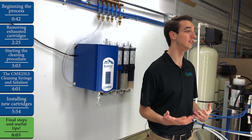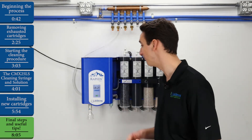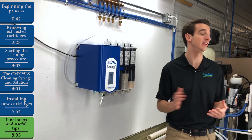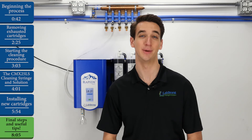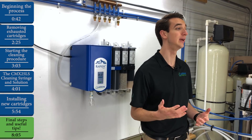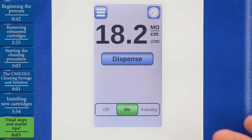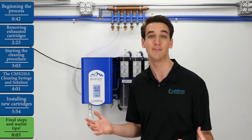Also, if your system isn't reading the ASTM Type 1 water purification standard of 18.0 megohm per centimeter or greater compensated at 25 degrees Celsius, that's completely normal. It might take a little bit for your system to rinse up to the ASTM Type 1 standard and for that reading to show up on your display. So let's dispense for about 20 or 30 seconds and see if our system might be leaking from any of the fittings.